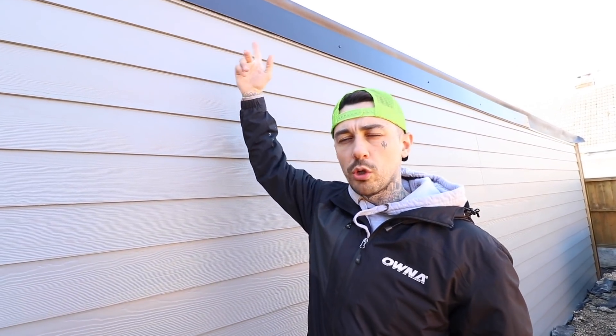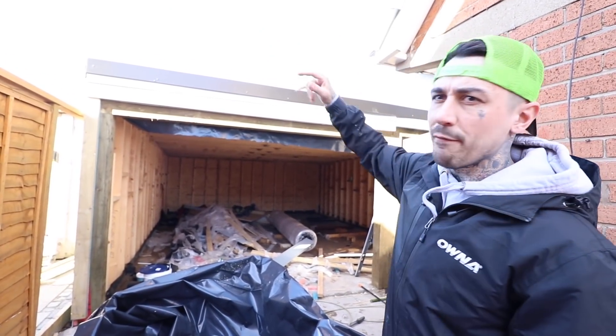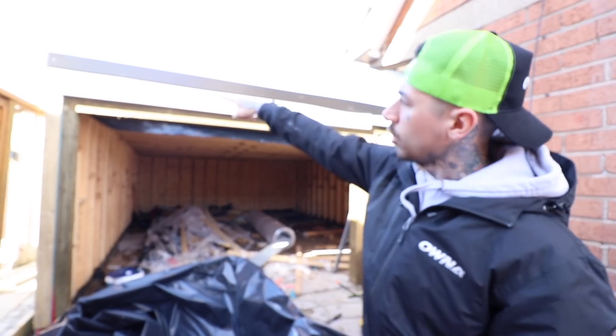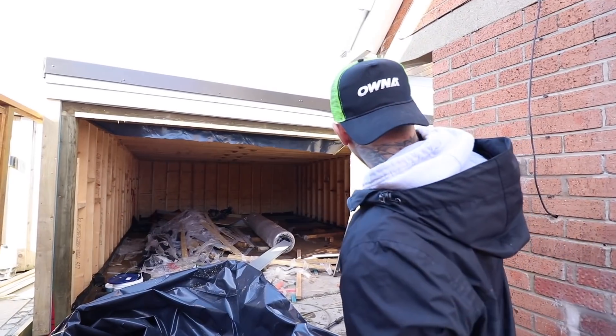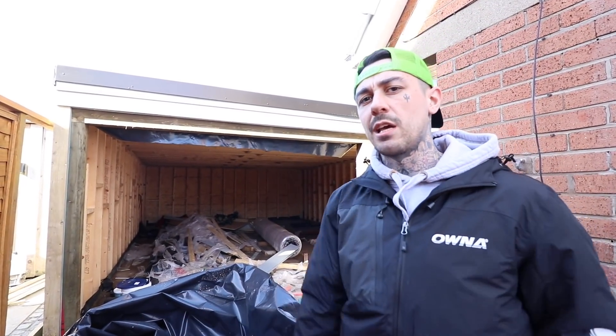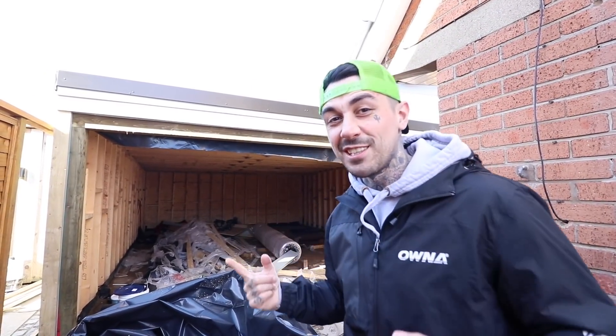I used 18mm tongue and groove boards on the roof and one solid sheet of rubber. We'll go back inside now and I'll show you the front. The exterior is pretty much finished other than some silicone — I've got a couple more little black screws to put in on top. I've folded and pinned all the rubber roof, put some additional bits of grey cladding on top, a couple of bits of wood down the side, and a UPVC black trim along the front. All the way around, it's fire-rated grey concrete composite cladding — fully done, all trims finished, and now it's watertight.